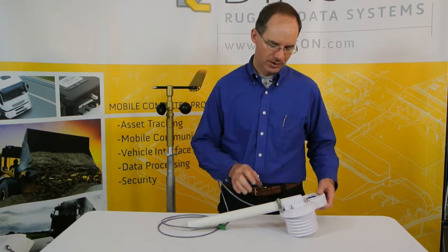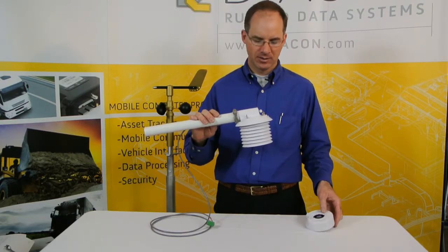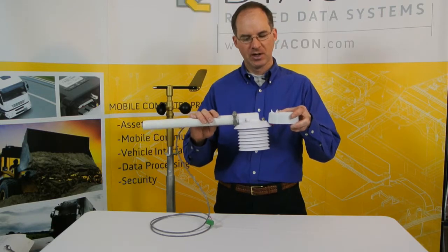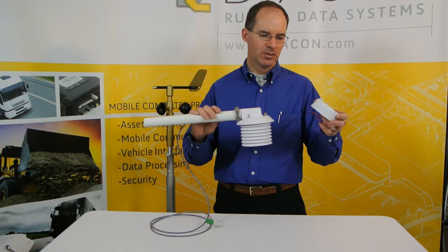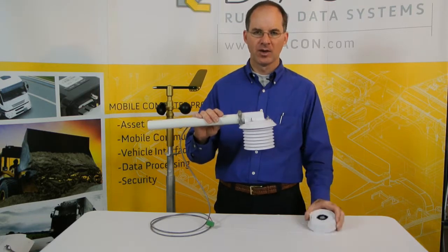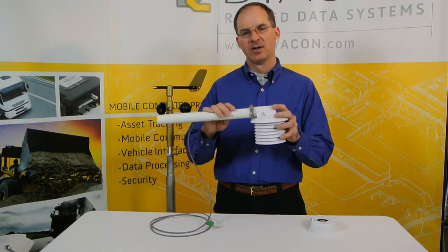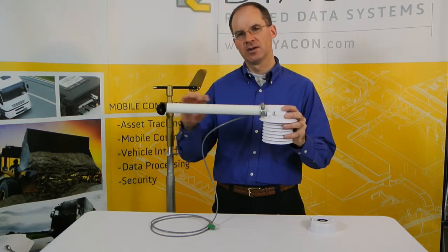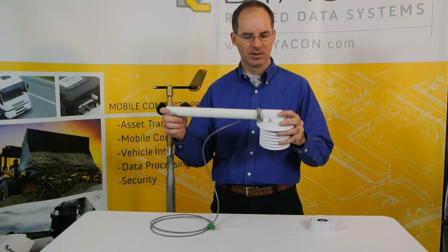Please watch our website for an upcoming feature. In addition to the TPH-1, this feature will provide an aspirated element to the air sensor. The aspiration module fits in between the top radiation plate and the mounting bracket. This incorporates a fan that draws any solar-heated air away from the temperature sensor and down the mounting pipe, which serves as a duct and discharges it away from the temperature sensor.